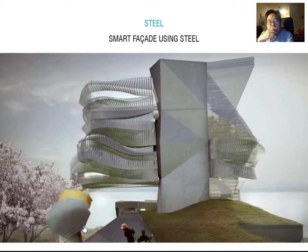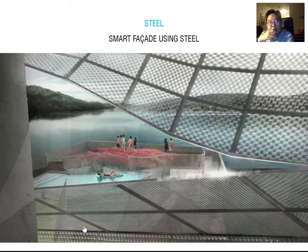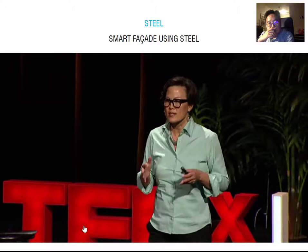What this basically implies is that in houses now we don't need drapes, shutters, or blinds anymore, because we can sheathe the building with these things as well as control the amount of air conditioning needed inside the building. I'm also looking at trying to develop some building components for the market. Here you see a pretty typical double-glazed window panel. Between those two pieces of glass in the double glazing, I'm trying to work on making a thermal bimetal pattern system so that when the sun hits that outside layer and heats that interior cavity, the thermal bimetal will begin to curl and start to block out the sun in certain areas of the building.